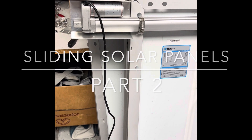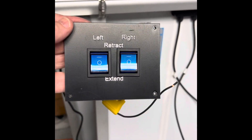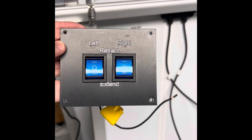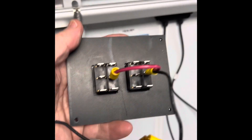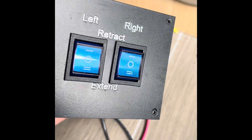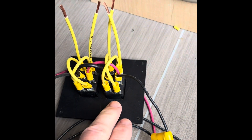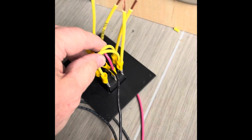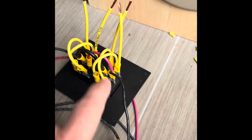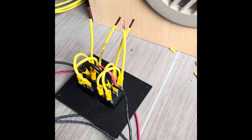For the next phase of the project I need a way to reverse these motors. I cut out this little plate using my laser cutter with two double-pole double-throw switches. This is for the linear motors to retract and extend. The positive and negative come into the center, and the wires reverse on each side to reverse the motors.